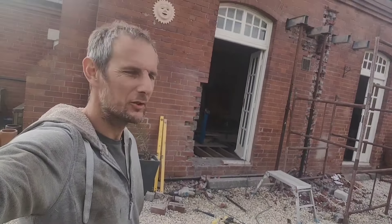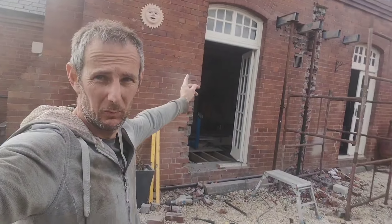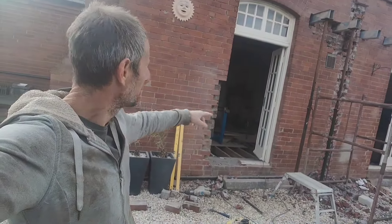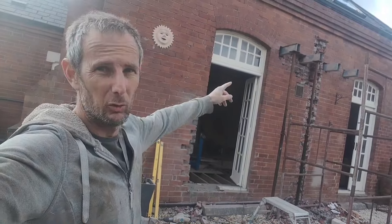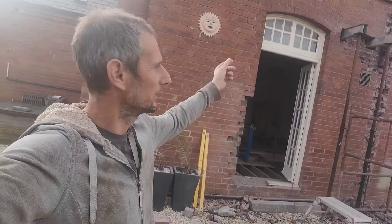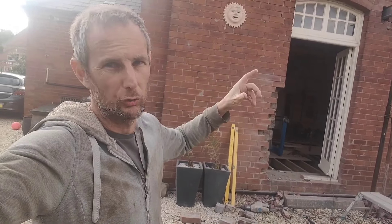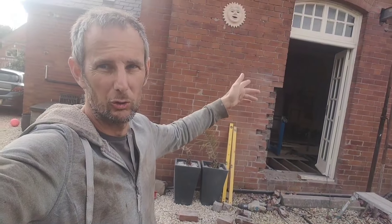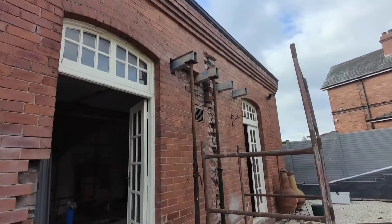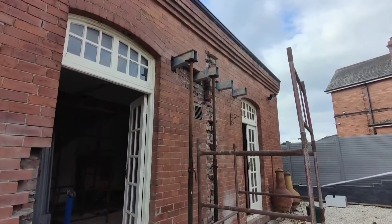Hello, we're back on the job. You saw us last week - we're in there putting that big steel up. That's on a video if you've missed it, go check it out - massive steel in there. But this week we are going to be doing the front. So we've got it - it's three courses thick, this building. We've got one steel up back and then the steel up front with like a 100 mil lip on it. So that'll cover two courses and the other steel will cover the course at the back.